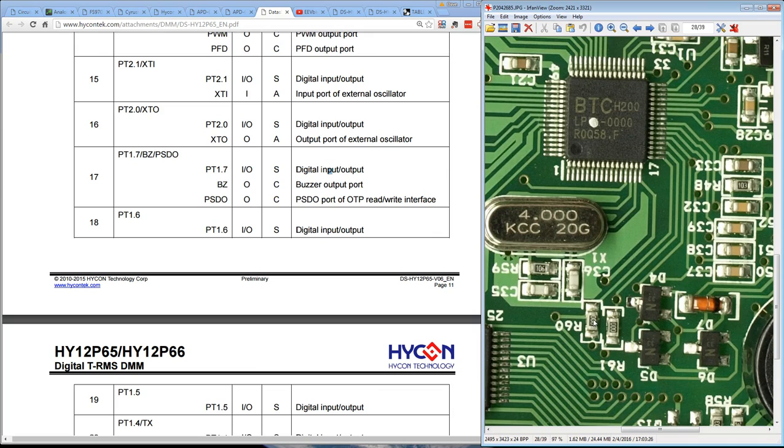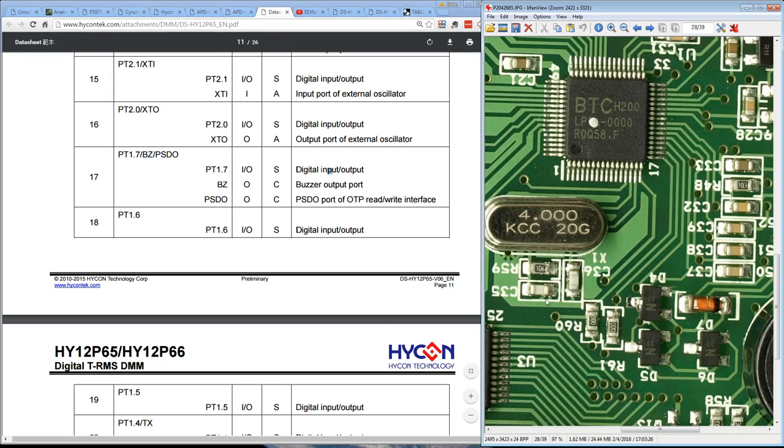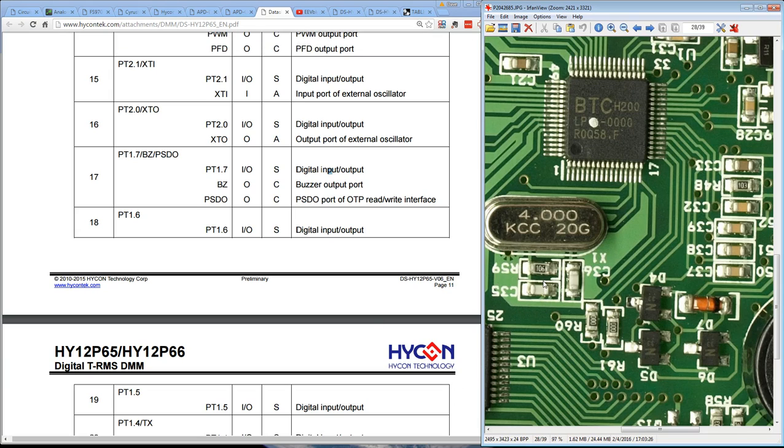So it looks like they're the two pins, and there's probably pull-up resistors somewhere. Yeah, there's a via here, via there. It probably goes off to a pull-up resistor somewhere, because an I2C's got to have some pull-ups.